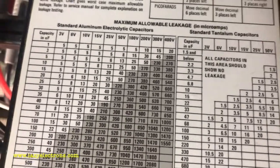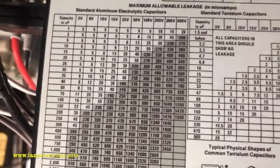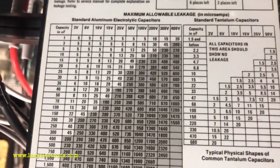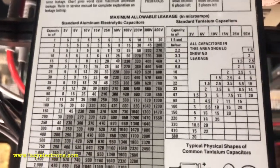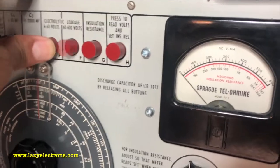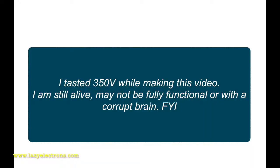What is the maximum allowed leakage current? That's a big question — it's entirely different from what you see for a modern electrolytic. I'll link a couple of web pages in the description where they list the expected leakage current for different types and values of vintage capacitors. Most important: at the end of the test, press and discharge the capacitor by releasing all the red buttons. Make sure you discharge the capacitor before you touch it or do anything with it.